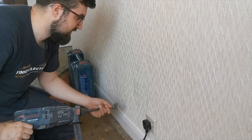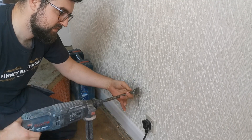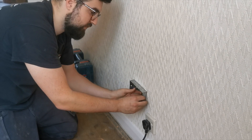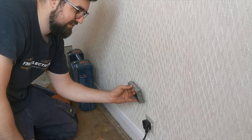Then we'll shave it up by running the drill back and forward with the drill bit flat, not on an angle. After shaving, you should have a nice flat back to the socket box. The back box should fit in nice and snug, not sticking out past the wall, and sitting square rather than on an angle.